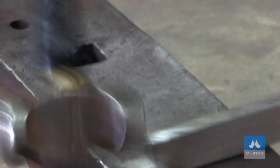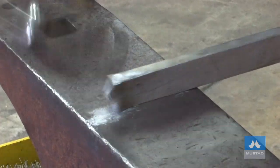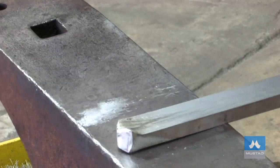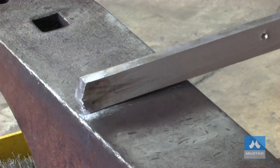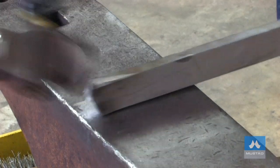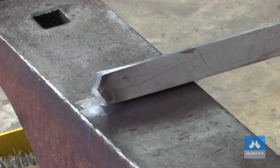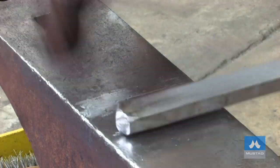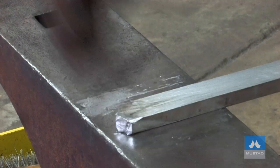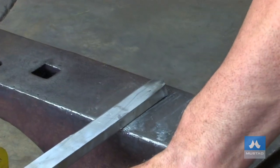I'll start with my outside heel, pulling the corners back, so I don't have to bump it up. I'm pushing the material back — I'm getting upsetting just by the way I'm forging it. The better I finish this heel, the better my finished product. I'll box it off a bit to where I can visualize where the first nail hole is.